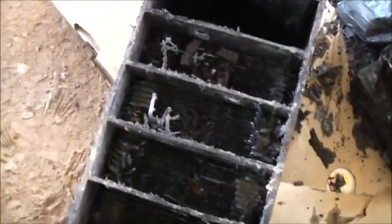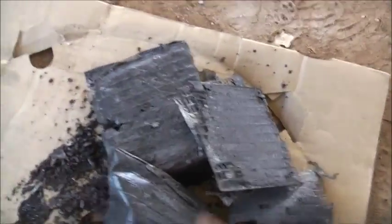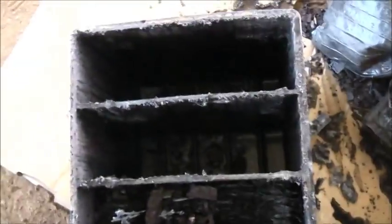Interesting. And you can see it's a centimetre baffle that the cells, the plates, sit on. It's got all that space over the lifetime of the battery for the bits of lead to fall off and accumulate. If there are gaps in there, they fill up. Obviously the battery's stuffed, it shorts the plates out, and that's it, your battery's gone.